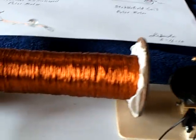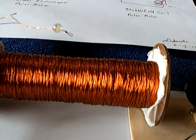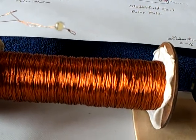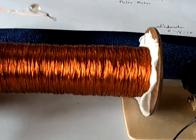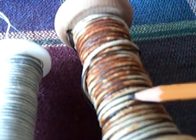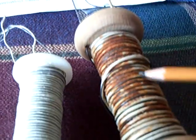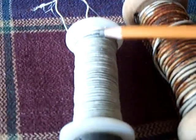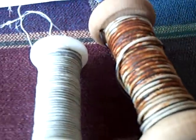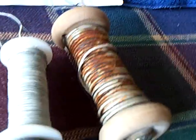The coils underneath that red copper wire are cotton-covered copper and galvanized steel wire, and they look like this. This is when it's fresh, and this is after it deteriorates and the zinc is gone. That's how the coils end up — with rusty steel wire against cotton-covered wire. This is pristine, and this is how it looks after it's deteriorated and gone down to that two to three-tenths of a volt.